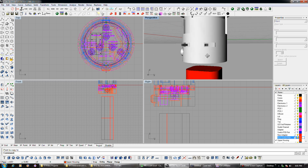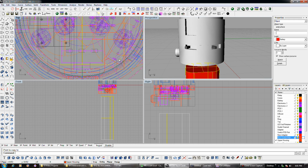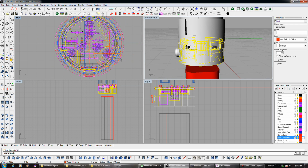And I pretty much determined, by the way, that I'm probably going to want to add about a 16th of an inch or more to the radius of the next part we form. Again, it's awfully tight on this battery, coming awfully close to these walls that you see there. So I'd like to add a little bit more play as a tolerance for error. I'm going to make it at least a 16th, if not larger than that, probably 100 mil.